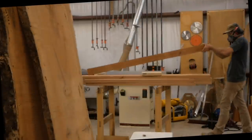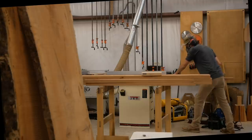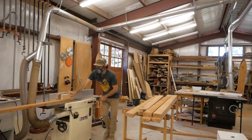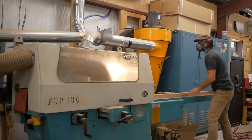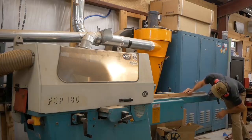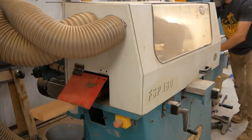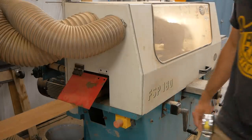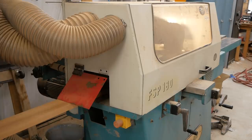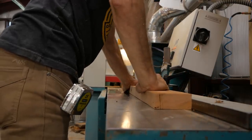I have all my boards roughed out, so now I'm going to the jointer to face-joint and make sure I have a nice flat face to start into my S4S machine. This machine surfaces on all four sides — that's what S4S stands for — and leaves me a board ready to laminate together. If you watch my channel you know it's a huge time saver when it comes to milling lumber. By far the best investment I've made in equipment — not glamorous, but it saves a ton of time.